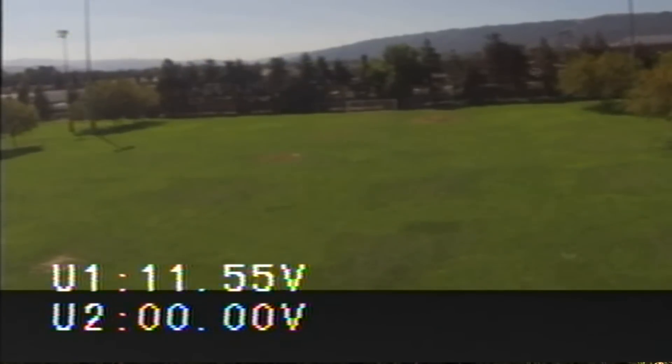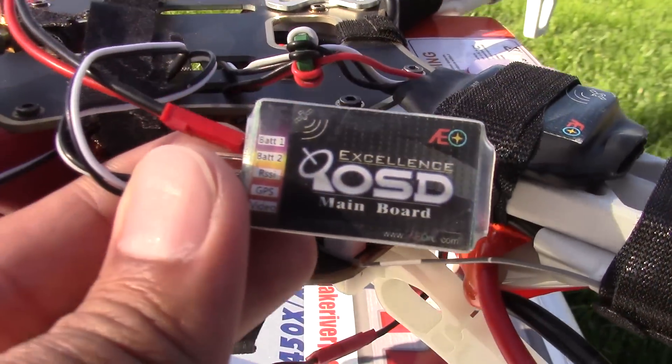The voltage display on this mini OSD is actually pretty close to accurate in my experience. It shows you the battery voltage under load, so whatever is showing is how much load the battery is taking and what's left. Once you land and the motor turns off, it will jump up to the no-load level. You can pretty much rely on it to give you an accurate battery voltage readout.